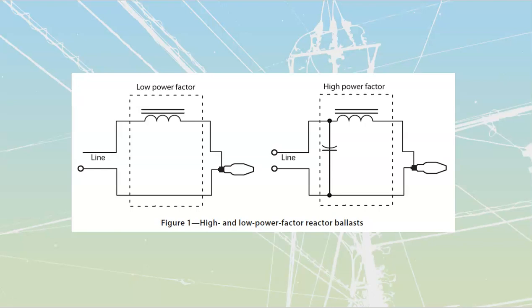They're going to be varnished magnet wire that we place in there. They call it magnet wire because we use it to make magnets, not because it's actually ferromagnetic. But it's going to have a thin coating of varnish on there. Once again, this is an oil-based product, which means it is sensitive to temperature. As soon as you heat these ballasts up too much, either by putting them in too high of an ambient, or by running too much current through them, you look at evaporating all of those VOCs, the volatile organic compounds, out of your insulation, which leads to insulation failure. So just be careful with the temperatures that you place them in.